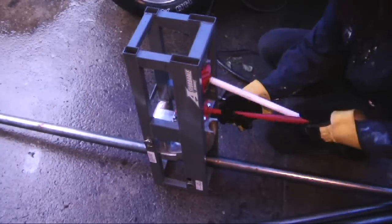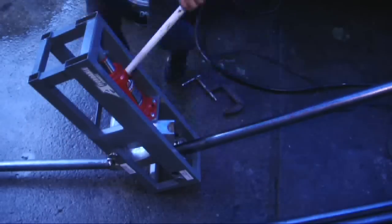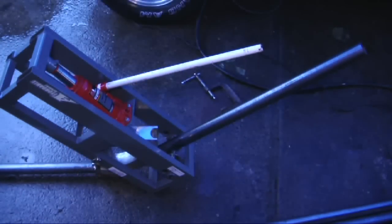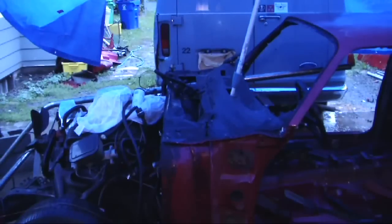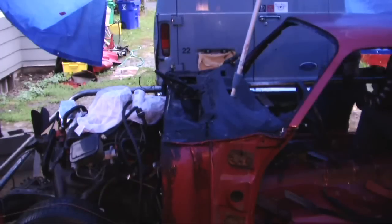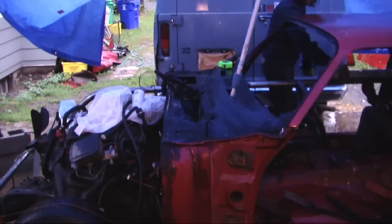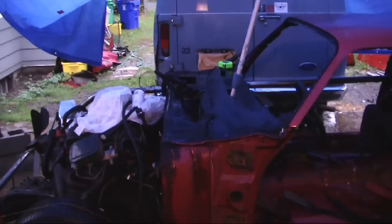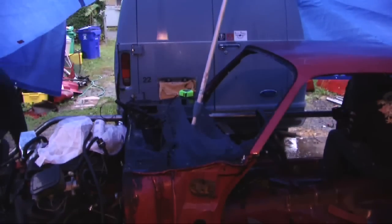Back to fighting with the tubing bender. I think she only paid $300 or $400 for this thing — really good value, honestly. I'm using a piece of wire to estimate the bend. When I had the tube through there, I bent the piece of welding rod — the wire — to the contour I wanted. Just fish-mouth it here and cut an angle across the bottom so it will tie into the subframe. Fish-mouth the back and then cut the front.